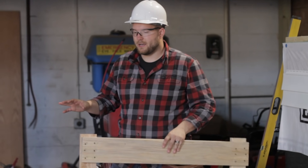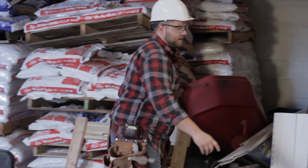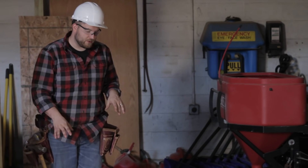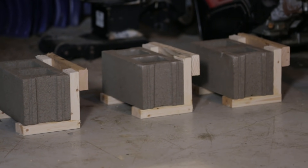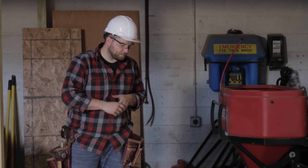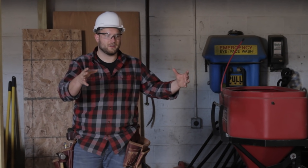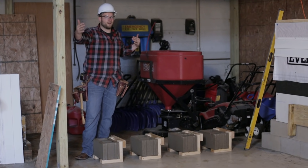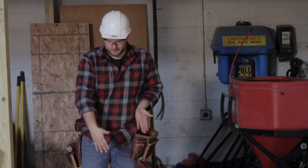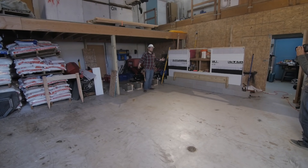Because we're in a garage with a concrete floor, I can't drive stakes into the ground, so we have these little batter boards made out of cinder blocks. We're only going to set up four, basically establishing our four corners, and then we'll be able to get everything else we need off of those four corners. This is just going to be a little eight by seven-and-a-half foot deck, but for a full build you'd want batter boards with a little bigger width to dial in your string over a 40- or 60-foot run.